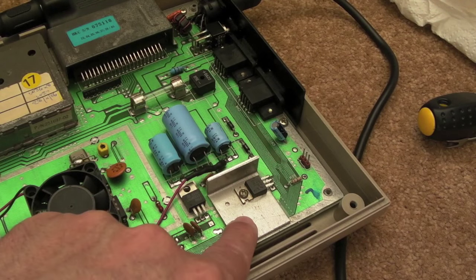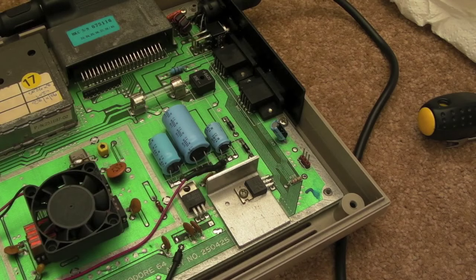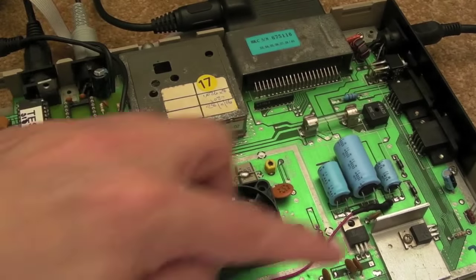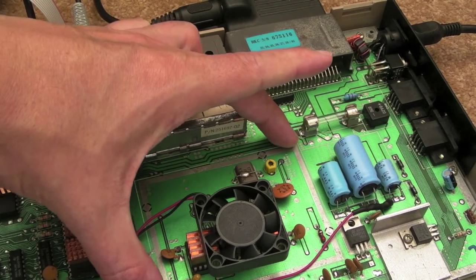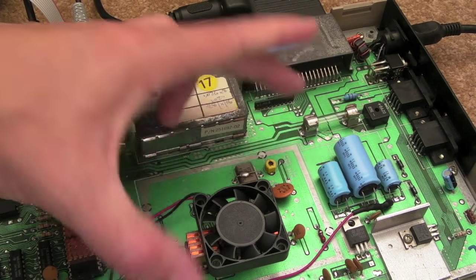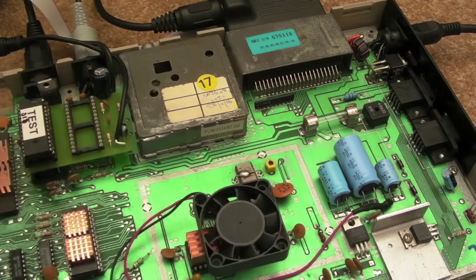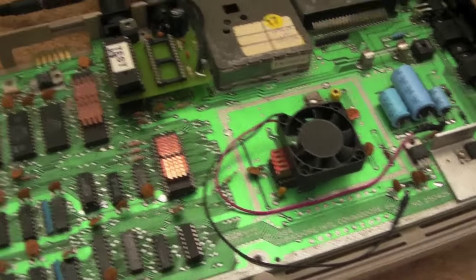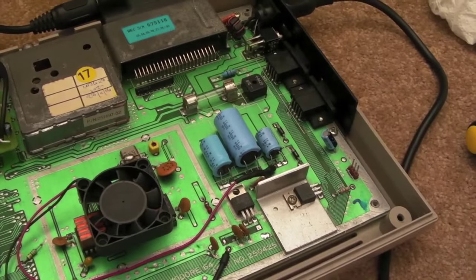Boak made the comment that the '5 volt can' presumably refers to the VIC — everything inside the can here — so that's what it references on the schematic. It's providing a 5-volt supply for the VIC independently of the 5-volt supply for the rest of the board. Maybe it's to do with noise or current — probably noise, I would think.